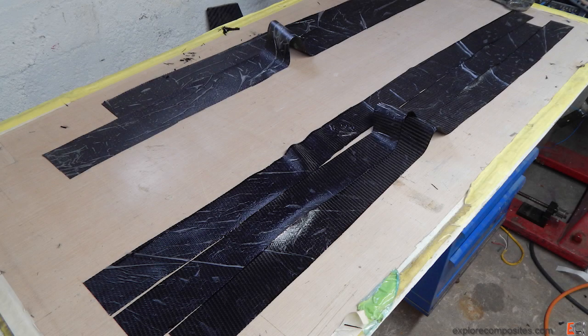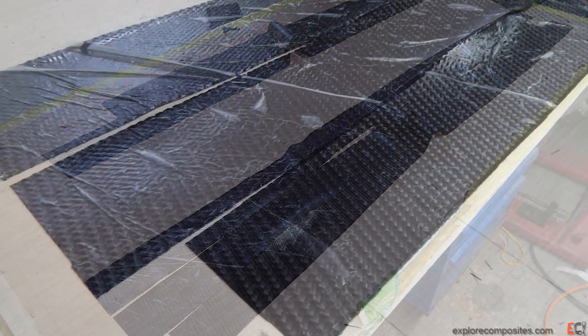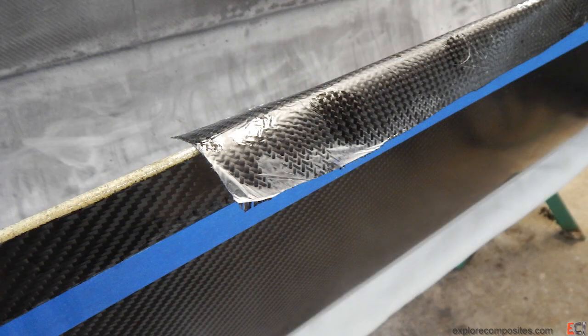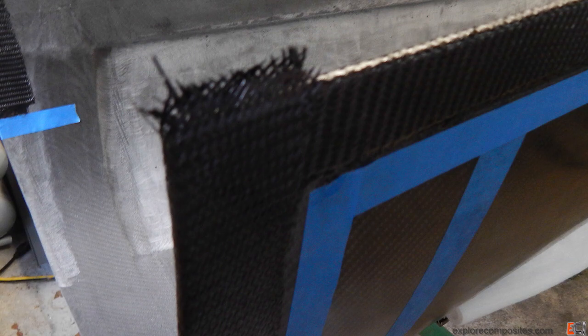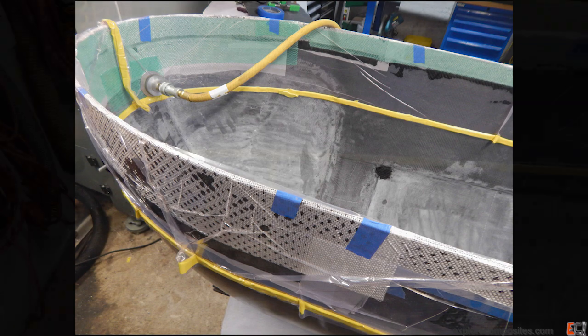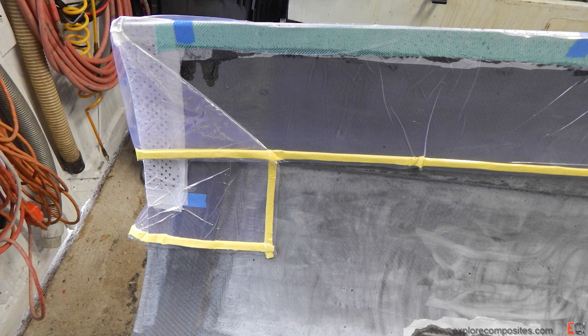Did a little fairing around the edges and did a closeout laminate of one layer of 200-gram / 6-ounce carbon cut on the plus-or-minus 45. I've laid it up on painter's plastic on both sides to get a minimum amount of resin, and here I am sticking it on there. Because it's plus-or-minus 45 fiber orientation, it conforms really nicely. I'm doing the same with the peel ply, also cut on the bias — plus or minus 45 degrees to the joint. Using the fiberglass breather method again with a little bit of green flow mesh here and there.